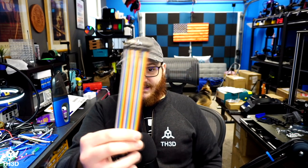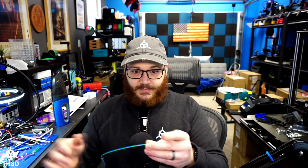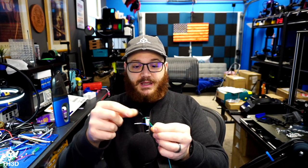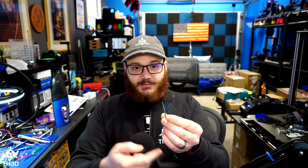One thing to note is, these come in all sorts of different colors. You don't have to use the red and the black. What's important is that you remember what color you used for which wire. So let's say I had a green and a blue, and that's all I had, you can still use the green and the blue for your fan. Just remember which one went to red on the 2-pin plug and which one went to black. So if I put the blue into the black wire, blue is now my negative. And if I put the green into the red wire side, that's now my positive. So just make sure that you remember, if you do use a different color other than red and black, which ones went to which wire on the plug.